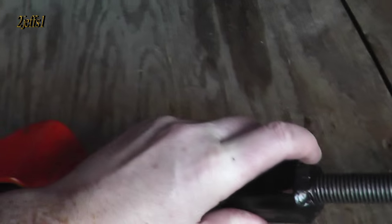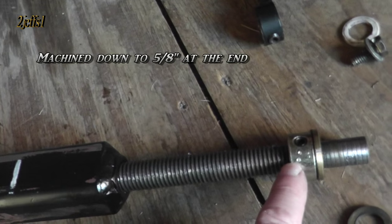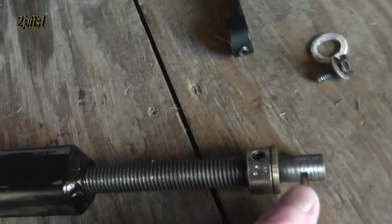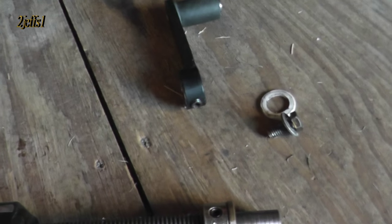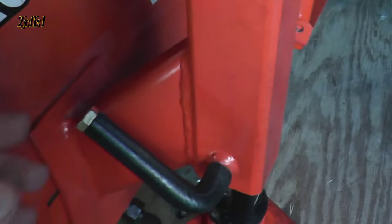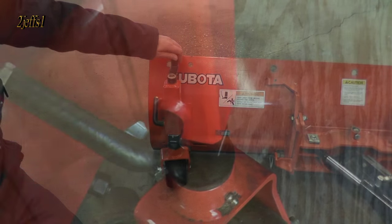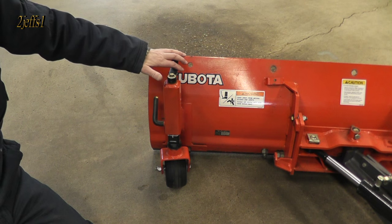This here is a three-quarter-inch nut and three-quarter-inch threaded rod with a set collar on it. The bronze bushing goes inside the tower and then another bushing goes on the top, along with the crank and bolt. Inside the crank handle there's a steel sleeve with rubber hose pushed over it — it's just drilled and tapped into the arm. This here is a three-eighths bolt with a piece of three-eighths rubber fuel line over it.